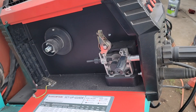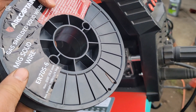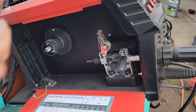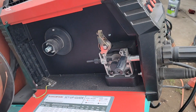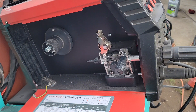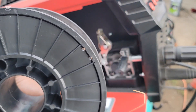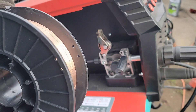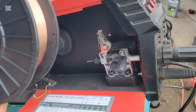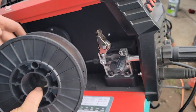Notice right here your wire is pinched off in there. You want this wire to unroll from the bottom. We're going to pop this out like so — make sure you have your finger on it, because this thing will unspool and make a big mess and you'll have a lot of problems. Clip this bent end off, keep your finger on it, and line up this little slot with this lug right here.